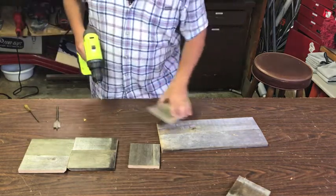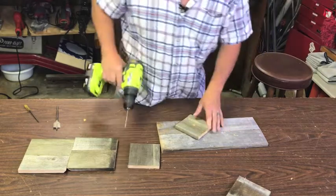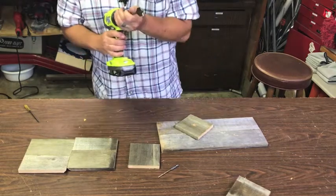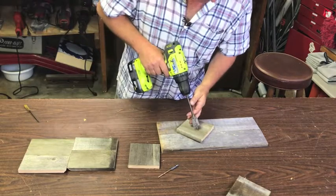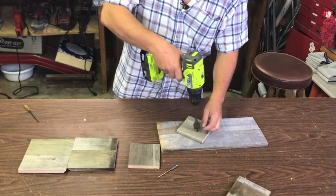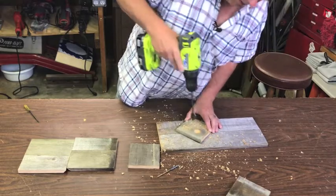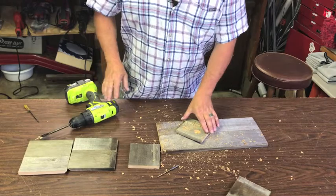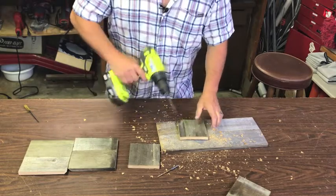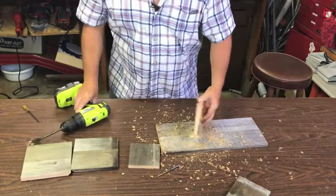If the fit's not tight, I'll epoxy it in. Right here — that was easy. And then right above it, right between the peak and that hole is where I'm going to drill the entry. Now, I don't go all the way through — because you'll just tear up the back side. Once the bit's pilot point goes through, flip it over and finish from the other side. And there you have it: a nice clean hole.